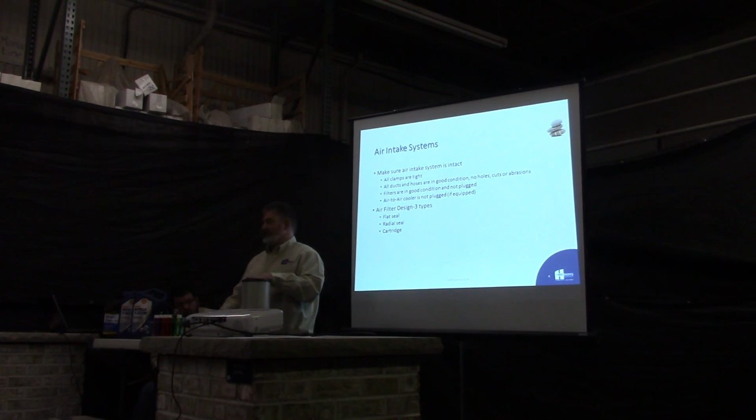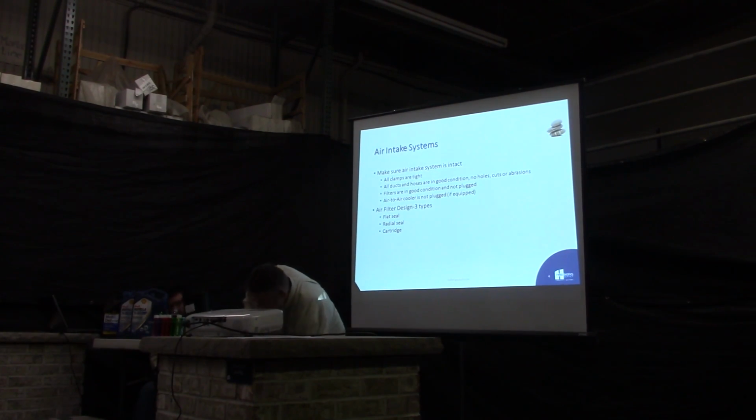What these have that's nice is they usually have a safety seal or a safety filter on the inside. Don't skip this. A lot of guys figure it can stay in there for 20 years. Change this annually when you change your filters out. You normally don't need to clean this, because if you're starting to clean this, it isn't working. This should always look fairly decent, but change it anyways. Now this one seals on the inside, where this one here seals on the outside. Just gives you an extra added protection for the engines.